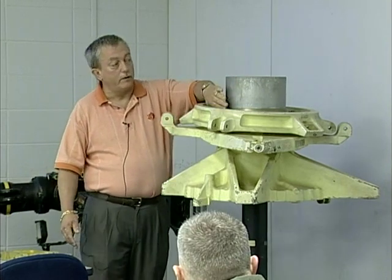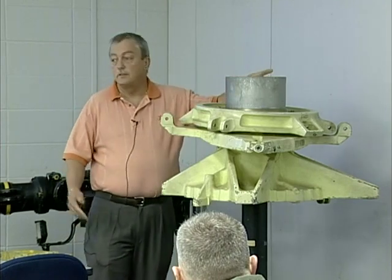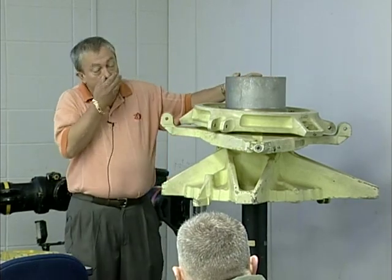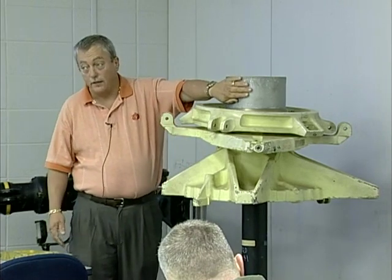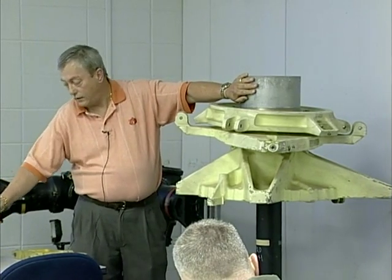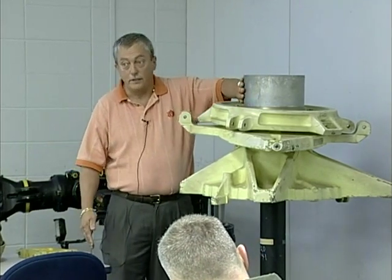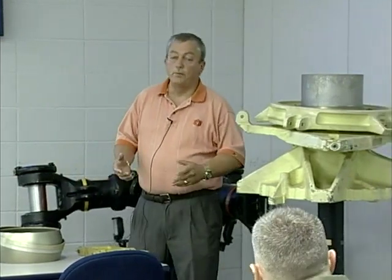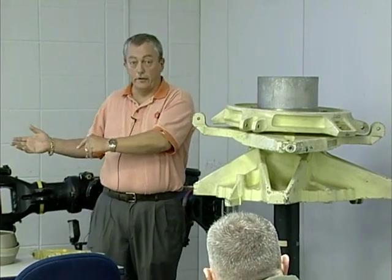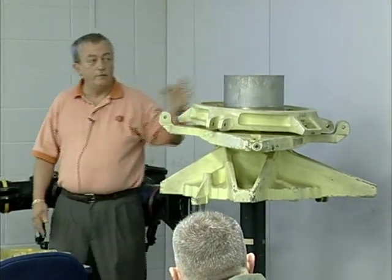When we talk about the ball that slides up and down, you'll understand the importance of keeping it clean and smooth. It's made of a tungsten type carbide material. If you observe any nicks, dents, or scratches, they need to be worked out before we go fly. The bearings on the inside of the slider shaft are made of Teflon — a smooth surface — so this must be kept clean. When you go upstairs and do a pre-flight, it's not a bad idea to ask a flight engineer for a shop towel to wipe it off and keep all the dirt free of that area.